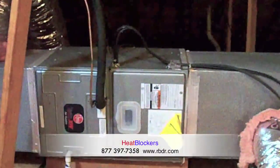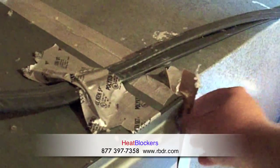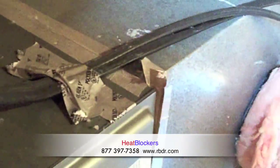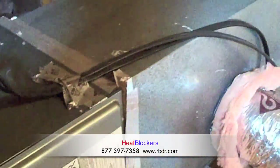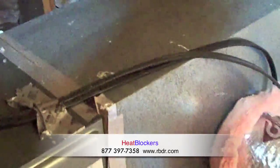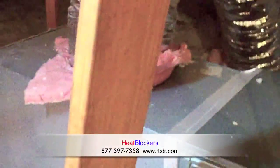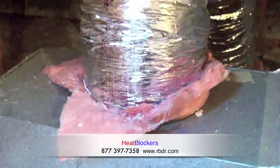I'll come over here and show you exactly what I'm talking about. As you can see, this tape has started to come away. That's one of the problems in the attics. If it's not sealed up properly, it'll start to leak and then you're going to be air conditioning your attic, and your bills start to go up. People wonder why, but that's one of the causes, and we are going to take care of that. We're going to seal the ductwork up. We're going to use a product called DAP, which is an expandable foam. We're going to create an airtight seal.